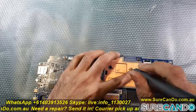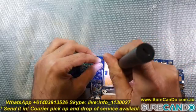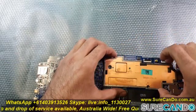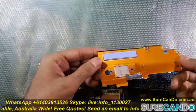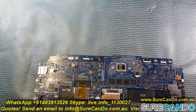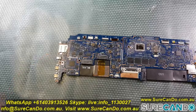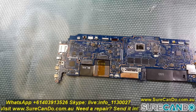Now my camera became faulty again, but what I did later on was check the motherboard on the thermal camera. Nothing got heated up, and I played around with some voltage checks around the board, and nothing was unusual. This told me the problem may be the BIOS chip itself. I decided to work on the BIOS chip first, and hopefully that was the issue, which is a lot of work, but it can be done.